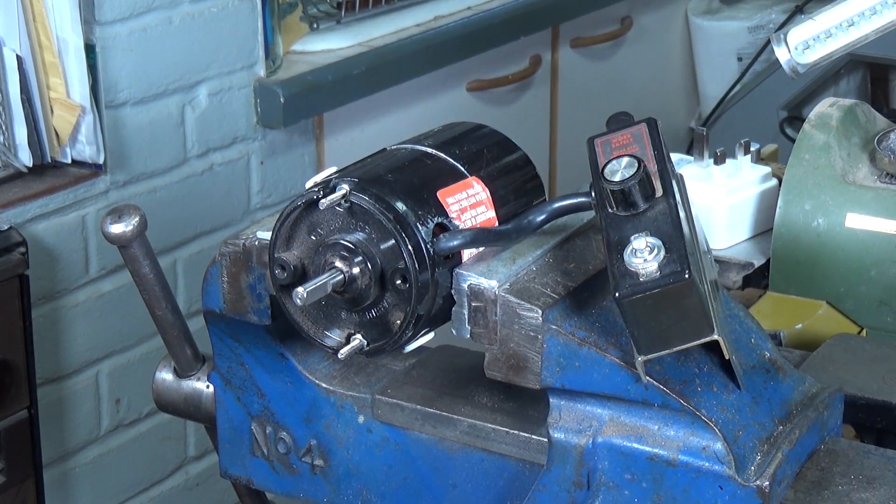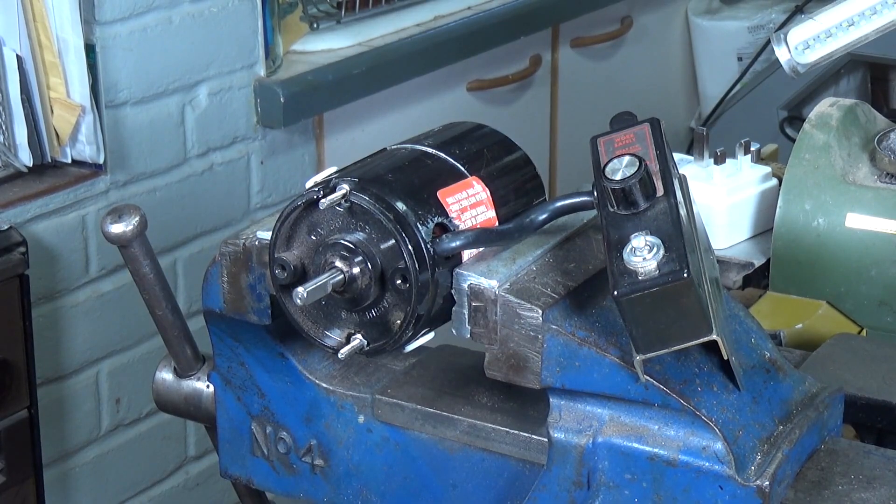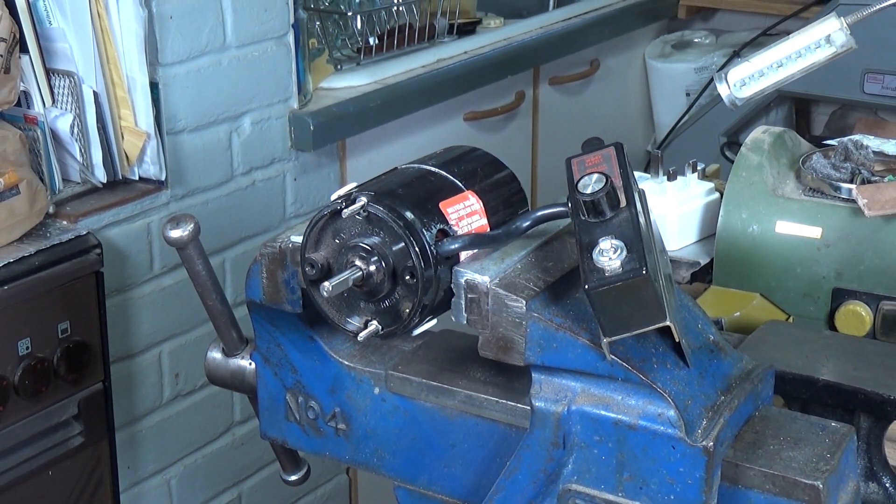I'm pleased about that - that's actually resurrected that motor for relatively little cost. The oil-lite bushing was only about a fiver, a little bit of work, and the thing is back running again. I still need to get a grommet to fit around the cable where I had to destroy the old one, but that's running okay - I'd call that a success. Thanks again everyone who made comments, especially Matt and Kev. It was Matt's idea to bush the bush and it works superbly. It's always worth investigating these things because you never know - I could have just thrown this away, but it's actually a perfectly serviceable motor. Anyway, that about wraps it up for the original Sherline 5000 mill motor - as always, thanks for watching, cheers.